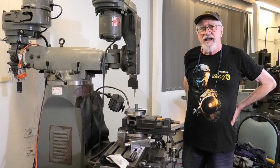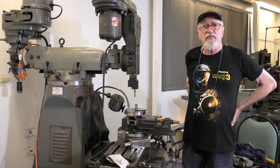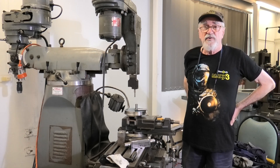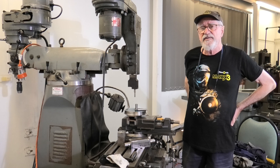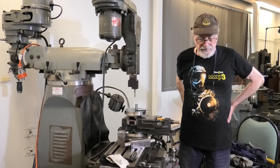Nice keyway attachment, does accurate work. Very cheap on tooling - just half inch high speed steel round. And I wouldn't be without it, low cost. It can also do internal gears and splines, but that takes a little bit of nutting out. I'll bring you in closer and show you a few jigs and how I use them.